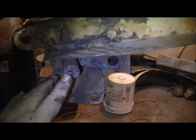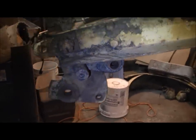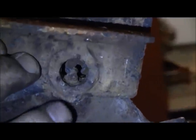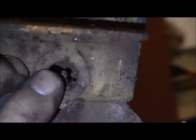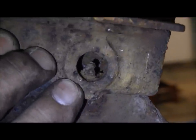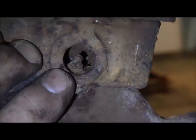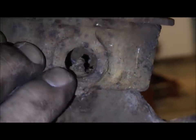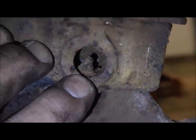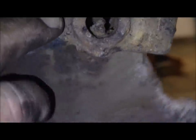Next we're going to attack getting the leg lock pin out. However there's an issue on the other side — in the pin hole there's a set screw that comes up through here to keep it from coming out by accident. Once the handle was bent it really can't come out anyway, but it's all rusted in place and it's blocking our progress. So I'm going to have to drill or grind that out, then heat and drive the pin out to free up this piece completely.